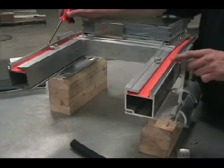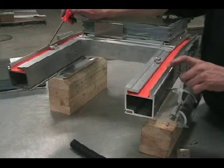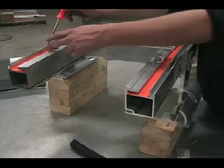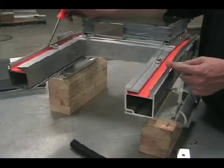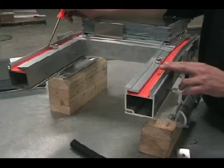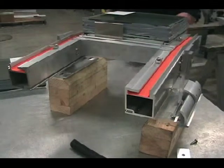And the notches and the mark. And we can do it for every bay, every other bay, every third, whatever it turns out to work. But you set the level in the notch. Hopefully the swivel clip isn't right there. I think it's going to be. And then you want to hit the mark over here. And even if the level rotates, the bubble will still work. And as long as you're centered, you should be in pretty good shape for squaring the frame if you're level at every crossbar.